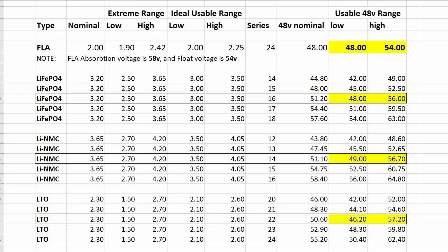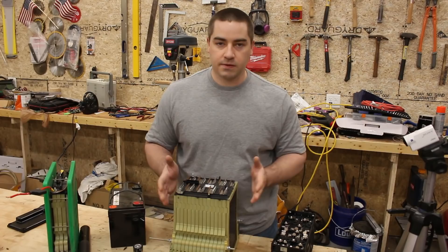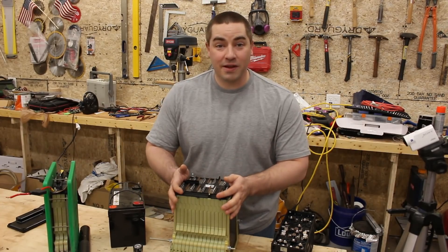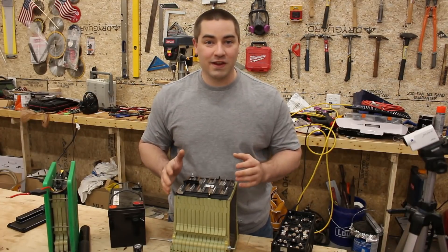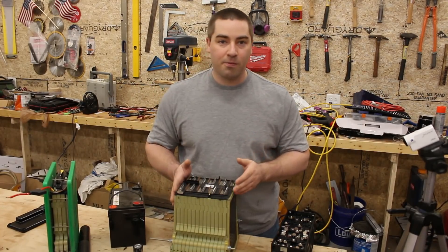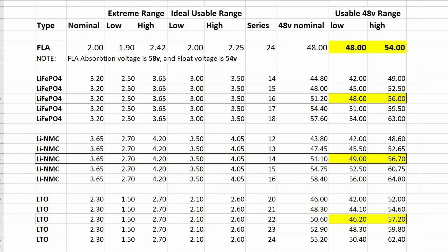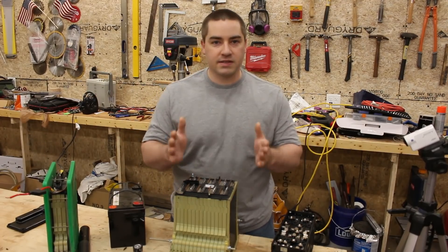The 54V would be your float voltage, and you probably want your absorption voltage even a little bit higher than that. That is the ideal range we want to be in for all of our equipment — between 48 and 54 volts. Alright, let's look at some other chemistries. We have lithium iron phosphate — that's the battery tower I have right behind the camera. They have a nominal voltage of 3.2 volts and operate between 2.5V and 3.65V as extremes. But typically you're going to want to keep those between 3V and 3.5V per cell. I personally think the ideal series connection for a lithium iron phosphate is going to be 16 cells in series, so we get to use the bulk of the battery's energy while staying away from the very bottom or very top end — extending our cycle life.